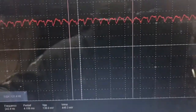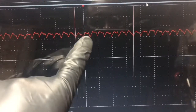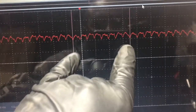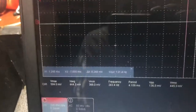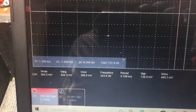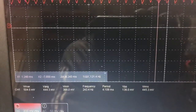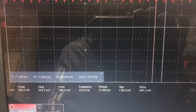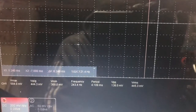We can now calculate RPM. We know it's eight commutator segments, so we count one, two, three, four, five, six, seven, eight. We look at the delta time between them — the delta time is 8.240 milliseconds. The calculation to get RPM is 60,000 divided by 8.240 milliseconds, which gives us an RPM of about 7,282 revolutions per minute. Remember, in our old pump we weren't getting that. This is just confirmation that we fixed the problem.